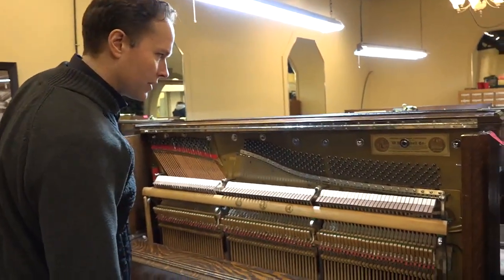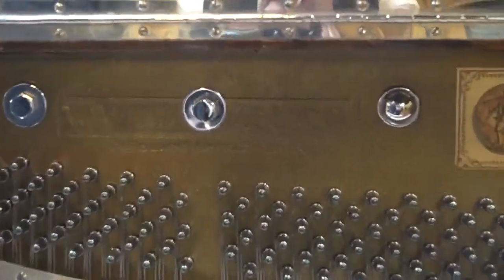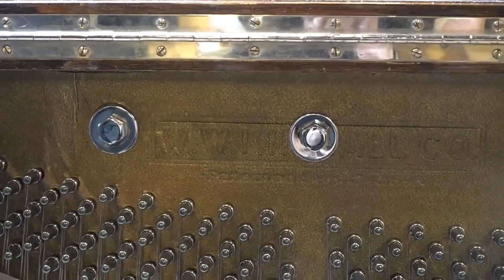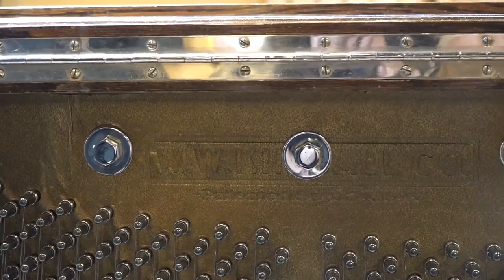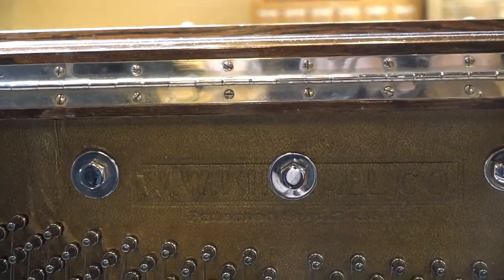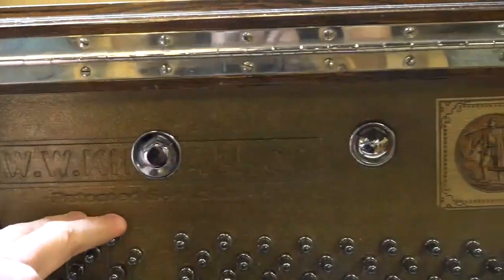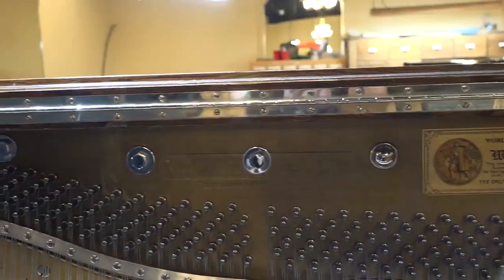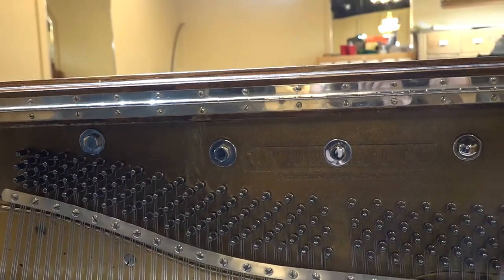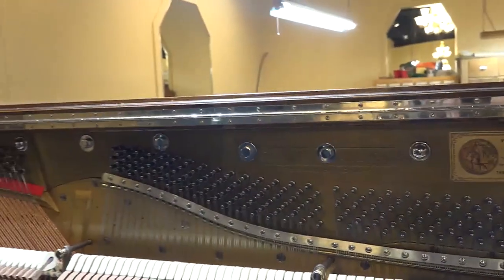So if you look carefully, we did polish these. These are just bolts that we got from a bolt supplier, because we didn't go to just Home Depot or whatever, because we wanted bolts that were a higher grade, and also they were kind of a specialty length. We ended up doing some extra tapping of about a half an inch on these bolts anyway, but they were ugly and they look like bolts that you get just from the hardware store. So we ended up polishing those on the drill press with sandpaper all the way down from like 60 grit all the way down to 2000 grit, and then we buffed them so they kind of fit with what these are. Okay, and let's check out the back.